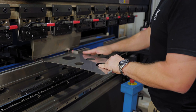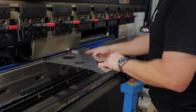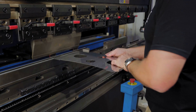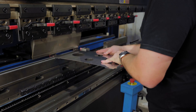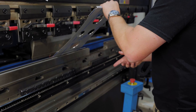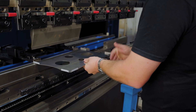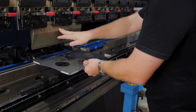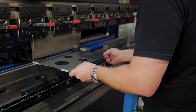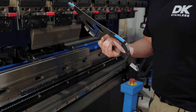With this one, you'll notice that if I go to fold up here, this bend or this part here will actually clash with this die. So what I'm going to have to do is move the backstops all the way over just to make sure I actually clear it. That's a trap for young players, that one. I move that back along, and you can see that I've already made the length of this top die perfect so it sits inside these two folds and actually doesn't clash. And that's one part done — this is actually one of our internal baffles.